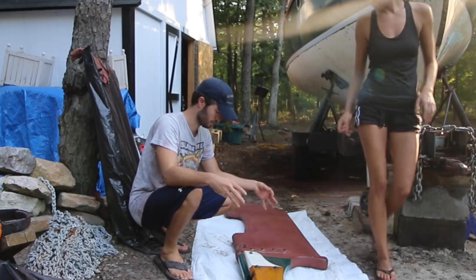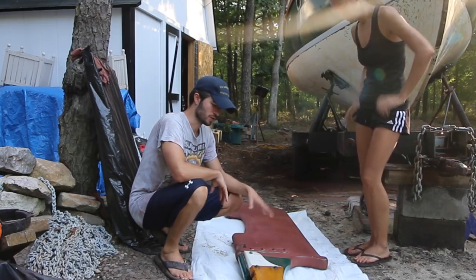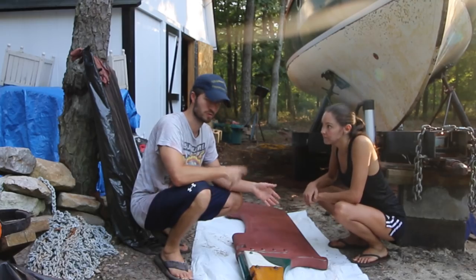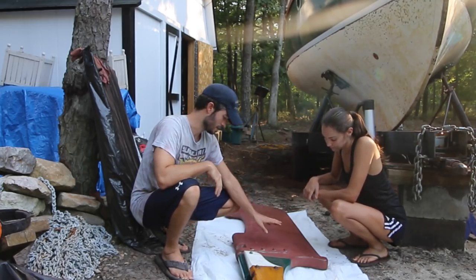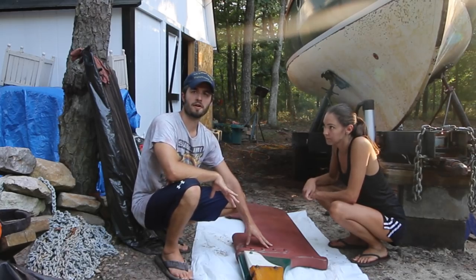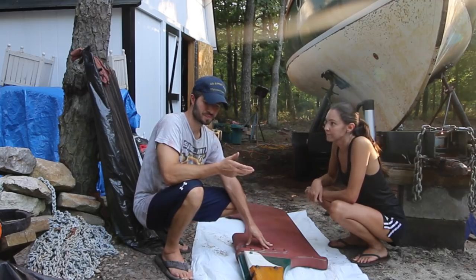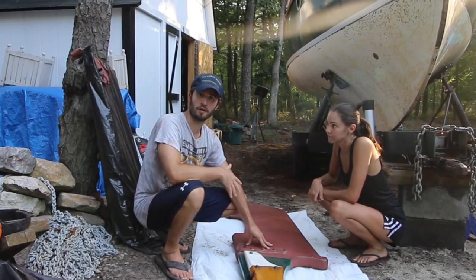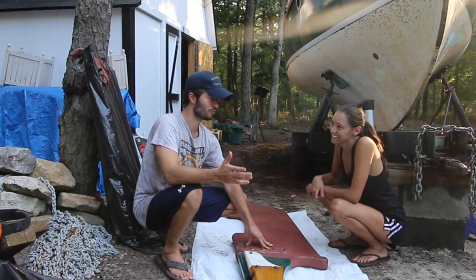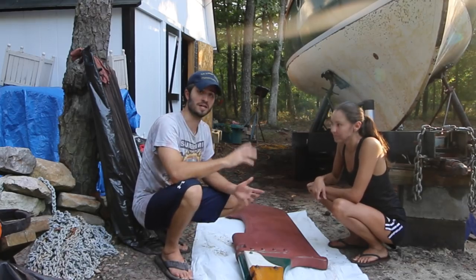With the rudder, he had it rebuilt. He recored it because when the surveyor looked at it when he bought it in like early 2000, most surveyors use a moisture meter like we do. More often than not, there's usually bronze or metal in a rudder and that'll trigger the moisture meter. In this case, that happened. The guy that rebuilt the rudder was like, dude, there was no water in here. I didn't even need to rebuild the rudder.